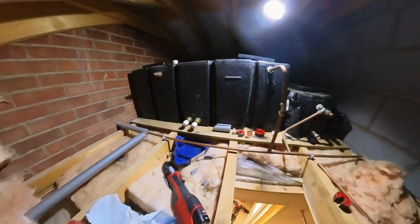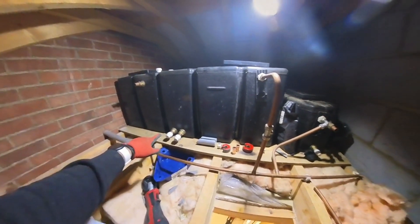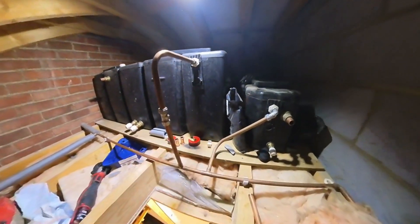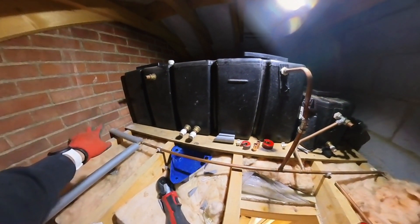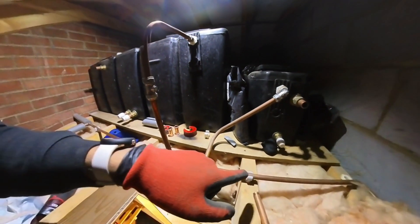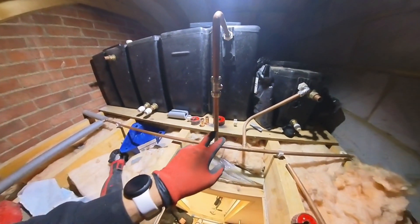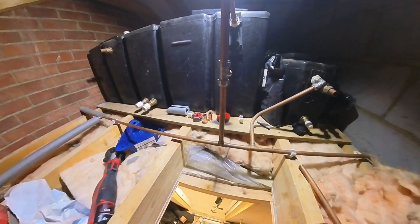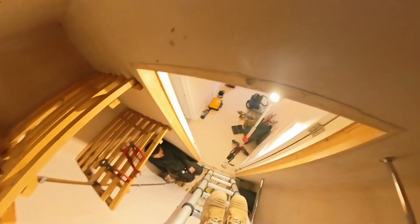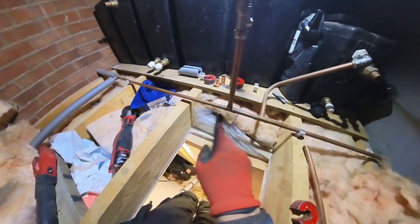Pretty much all done in the loft. There was only one feed coming off the tank - that was capped anyway and it was feeding the cylinder, so we just cut and capped that back. Nice that the overflows were in 22mm copper - nice bit of scrap there. We've got a cold feed coming up here, teeing off toward the bathroom and ensuite on one side, and going around to an electric shower in the bathroom. For the F&E tank and cold water storage tank cold feeds, rather than just capping it there, I'm going to cut here, cut here, add a coupling, and just make that a straight pipe through. In the meantime, Josh has ripped out the airing cupboard - we just need to sort that out in a moment.